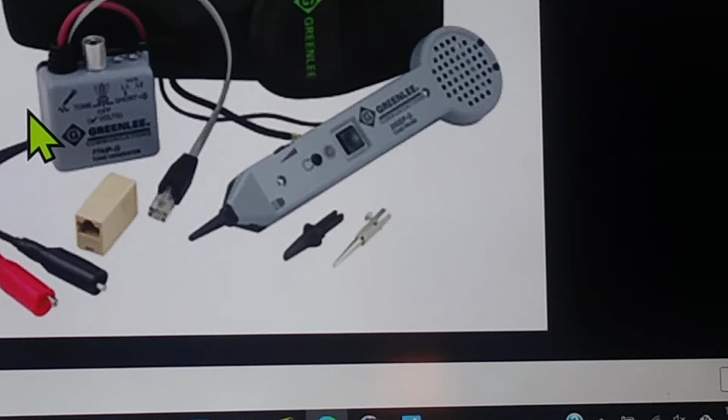One test you can do in that room to verify you're on that wire is to get a piece of wire, tie it to ground somewhere in that room, and take your grounded wire and touch it to that wire. Your tone should go out because you have shorted out the tone. If it doesn't go out, if it doesn't change at all, you're on the wrong wire. And keep looking in the area that you're at to spot that wire.